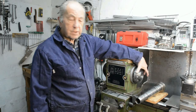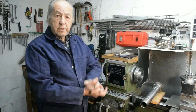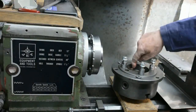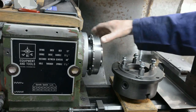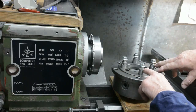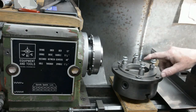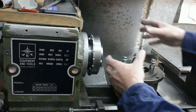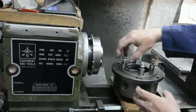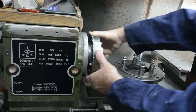This is much more substantial than the screw-on fitting. Let's zoom in a little bit and look in closer detail. The chuck has a female taper in here to match the male taper on the driving spindle. It's got four threaded stand-offs with four nuts on. The nuts are loose at the moment because all I have to do is put the chuck on, turn the bayonet piece to lock on, and then tighten up those four bolts. Very quick and easy as we'll see.